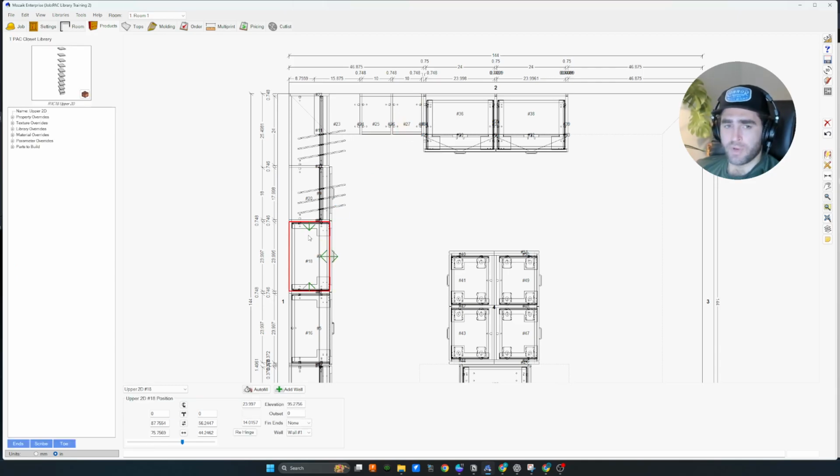So the reason we want to keep that is because all of our sections are 14-inch. If you go below 14 and you go to a 12-inch drawer, you will not have enough room to comfortably fit any folded clothes. So you're basically rendering that drawer useless. And the other thing you want to avoid is going to a 16, because everything just starts to change when you go to 16. Think about that front line bore that the closet rod is sitting in. Now it's sitting 2 inches further forward, and now you're wasting a ton of space behind that closet rod.